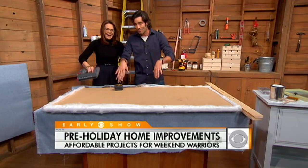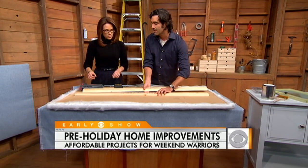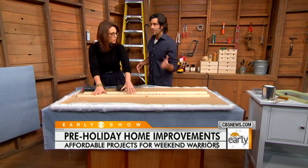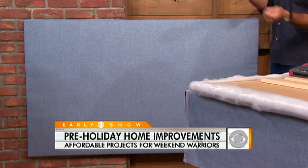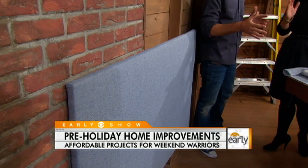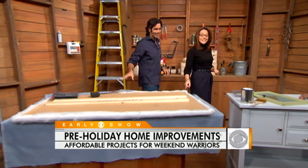What you want to use is a French cleat. Take a one inch by five inch piece of lumber and cut it at a 45-degree angle — that's a French cleat. You stick one side onto the back of the headboard, and then you take its counterpart and stick it on the wall. Gravity is just going to hang this headboard. The French cleat is not the same width as the headboard, which is important — that way you can move it left or right according to where your bed is.